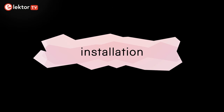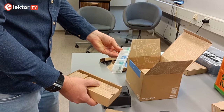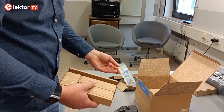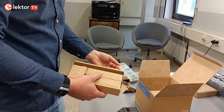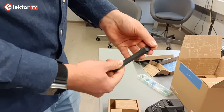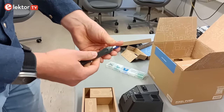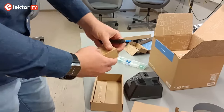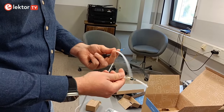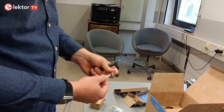When you take your Pixel Pump out of the box, you have accessories including a set of nozzles suitable for most components — a very small one for 0402 or even smaller components, and a large one that can carry MOSFETs and bigger ICs. You have the vacuum pen, which has a luer lock and nozzle in front to hold a typical needle — you just push them on, easily swap them, and get an airtight connection. There's also a silicone hose connecting the pen to the Pixel Pump, which comes with a user-serviceable filter to prevent debris from entering the pump and clogging the valves.